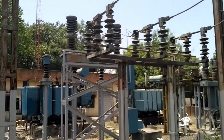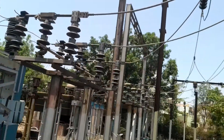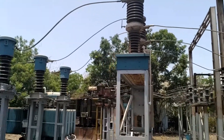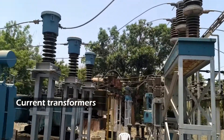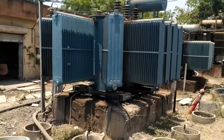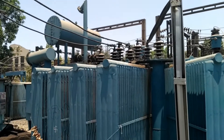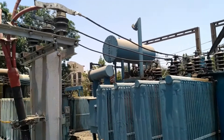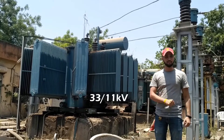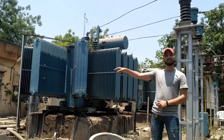This main bus is connected to a disconnector, and through the disconnector it is connected to a circuit breaker. Here you can see three current transformers to measure the incoming current through all three phases. Remember, we are still in 33 kV. This breaker and disconnector are specially provided for the protection of the transformer, which is a 5 MVA unit that steps down 33 kV to 11 kV.